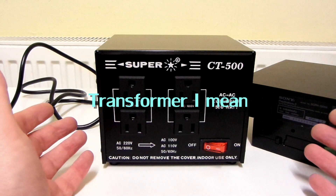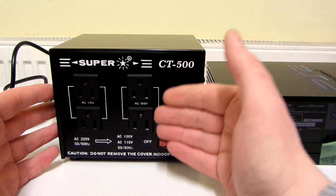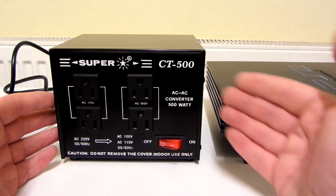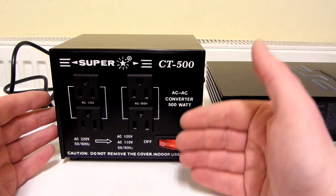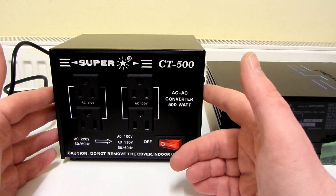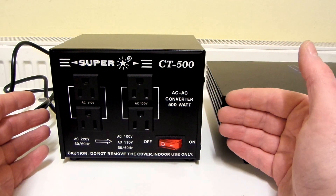This is 500 watts, and a lot of people say that the step-down transformer should be double — some people even say triple — the wattage of the device that you plug into it. If you were to plug in a 500 watt device into this 500 watt step-down transformer, even though they're both the same wattage, the step-down transformer would work for a short while. But if you were to use it for longer periods, like hours, the step-down transformer wouldn't really be able to power the device comfortably — it might put a lot of strain on it. Supposedly, though, it doesn't matter how high the wattage is of the step-down transformer; it won't cause any harm to your device.